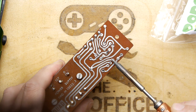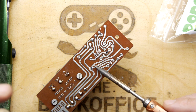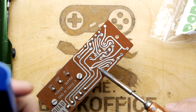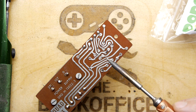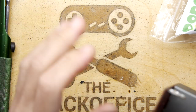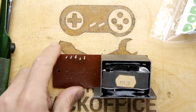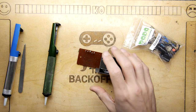And what you can do, if you're doing your own PCB as well, you can buy a chemical tinning compound. I can't remember what it's made of. And you can actually just dump your whole copper PCB in and it will deposit this tin on it after a few minutes. It's like a magic process, really. You just chuck it in the vat of crystals.